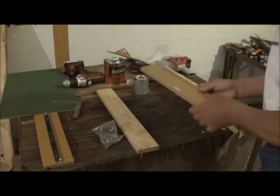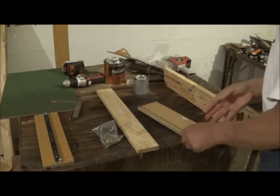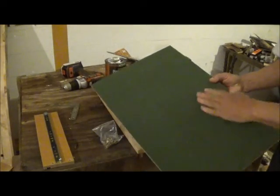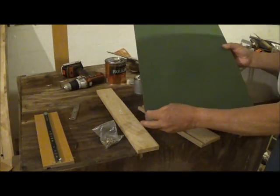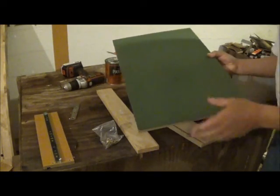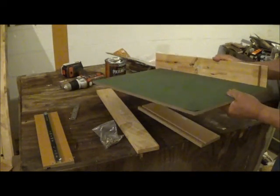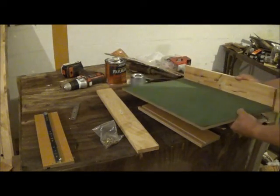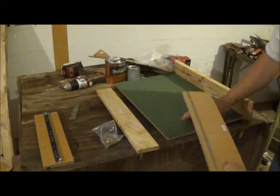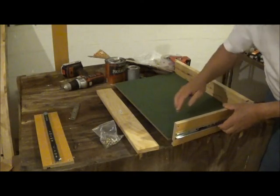These are the side rails here. Obviously this groove contains the bottom of the drawer, which is here. And it's nicely felted. This has a little kick up on this end — no matter, because the rear panel will go right there, so that will be taken care of. We just index this in these grooves, like here, and they go in very, very nicely. And we take our first side panel, here, and do likewise.